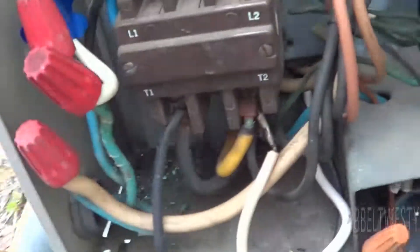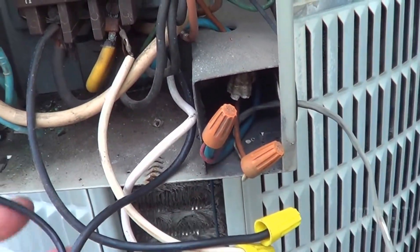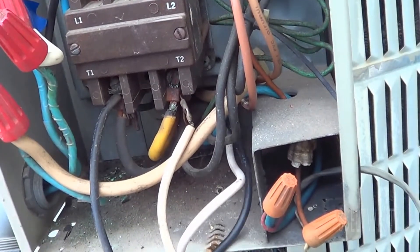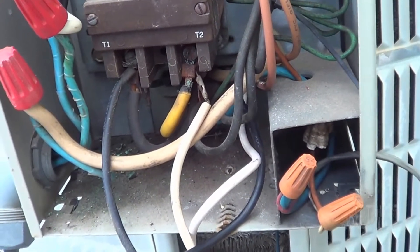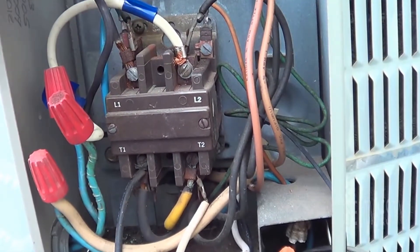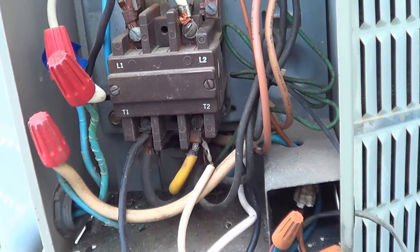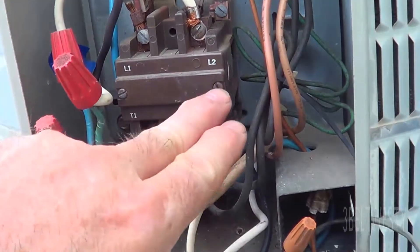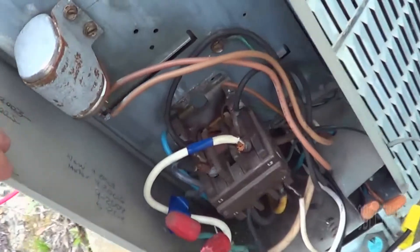This is buzzing here because the contact is powered by 12 volts or 24 volts, but I got all this off. This is a three-phase air conditioner, 240 high leg delta. It's kind of strange because when you've got the contactor on, the high leg isn't switched on it, which is kind of screwy. So they're only switching two of the legs, two of the phases — the other one's hot, which is probably not proper.